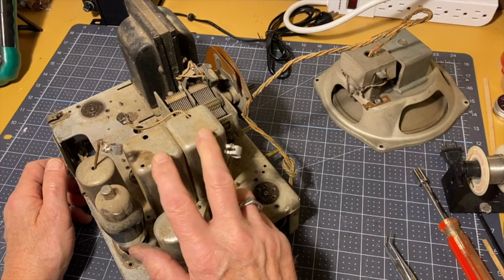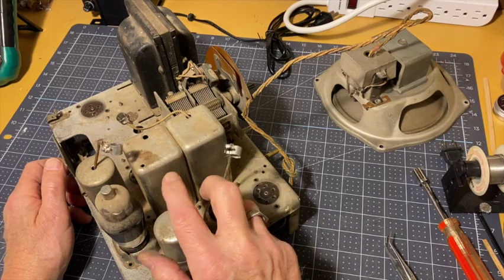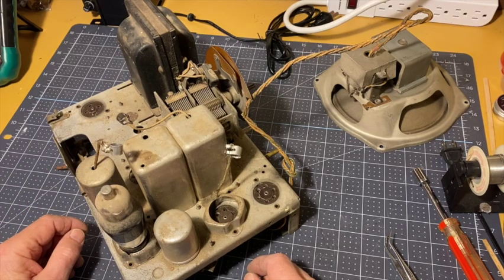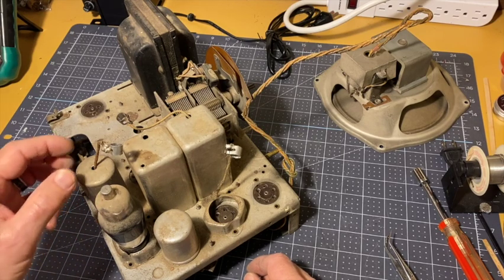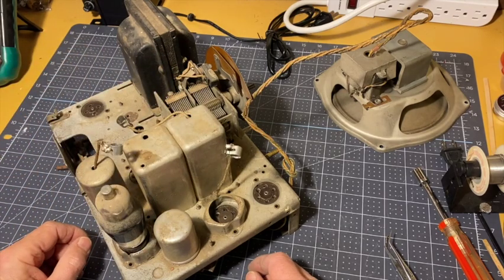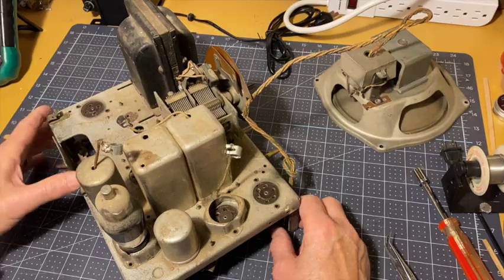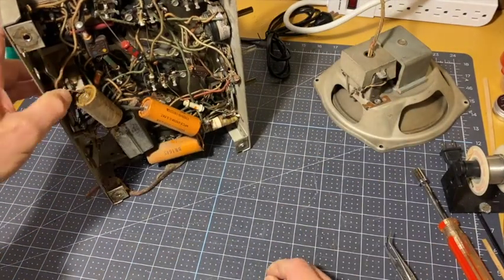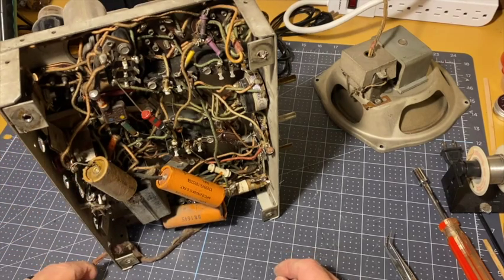I'll also check and validate these are IF cans. I'll make sure that there's continuity on the secondary and primary of these three cans. And then, once we have all that done, in the next video, then we'll know whether we have a go or not, whether we're in shape to move forward.